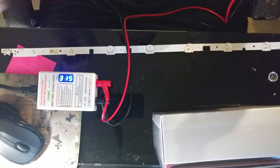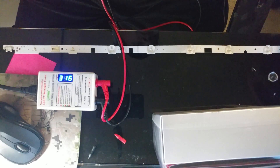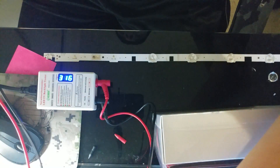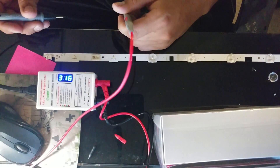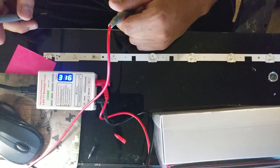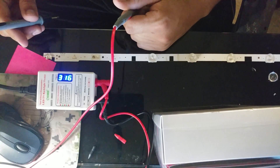You're going to need your LED tester. Not many people have this, but it's pretty cool — it's about 30 to 40 bucks on eBay. I buy it because I work on TVs. A different way you can do this is by plugging in your TV — sometimes you'll see a flash, and within that flash you can see which LEDs don't come on. You have to repeatedly turn it on and off, but you need the LCD panel off.